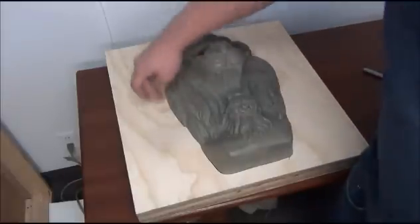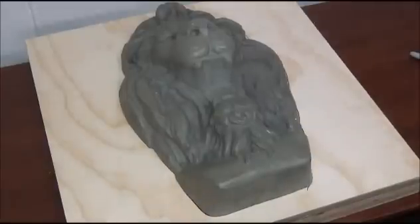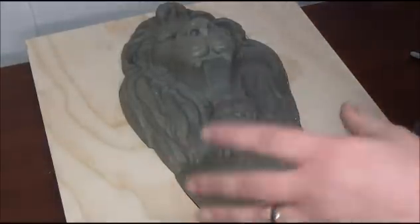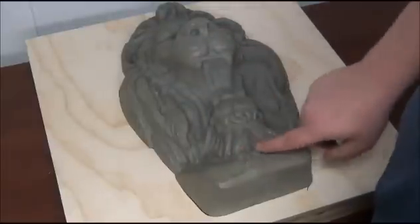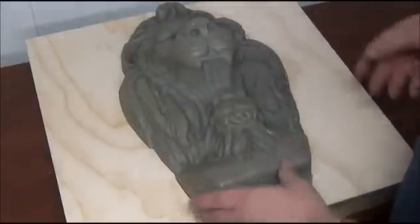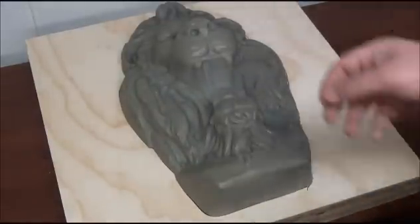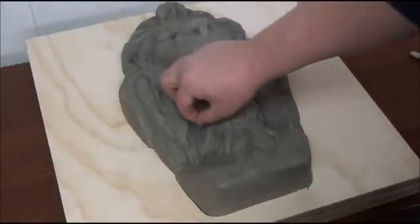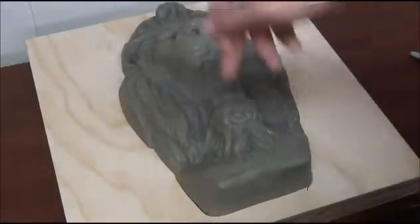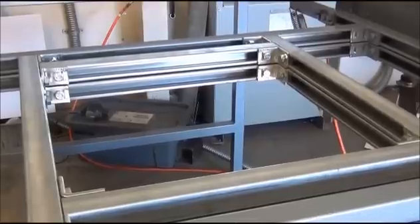When we place our mold back into position, we have vacuum holes all throughout the outer edge of the mold and the vacuum can draw down into those corners. Another thing to keep in mind: when working with a mold that has a lot of details, such as this one, it's going to be very difficult for the vacuum to get into the crevices and more detailed areas. So we'd want to use the same drill bit and drill directly into the mold — through the mold — so it reaches the vacuum underneath, going through the mold and into the vacuum chamber so the vacuum can seep through the box into the mold.